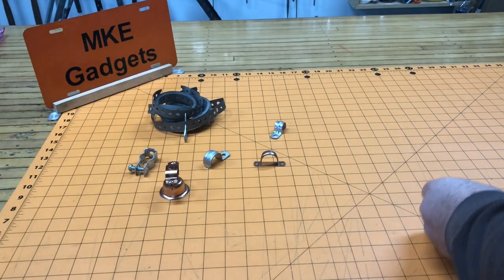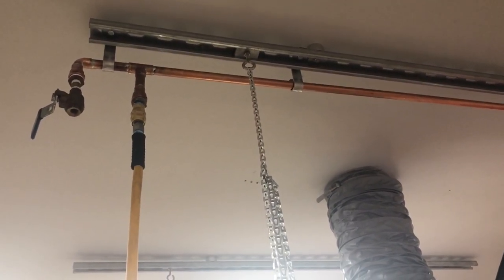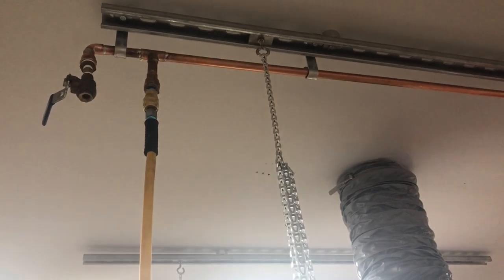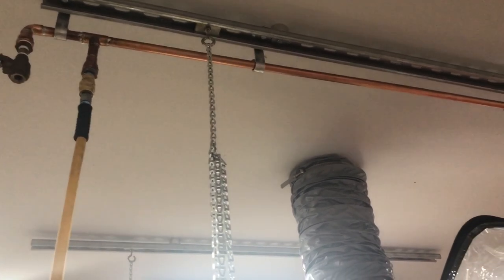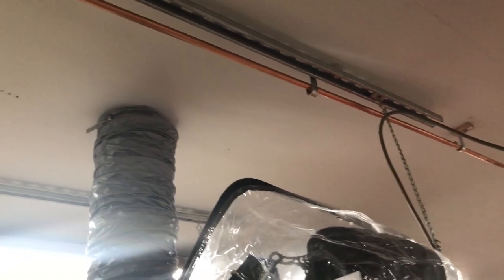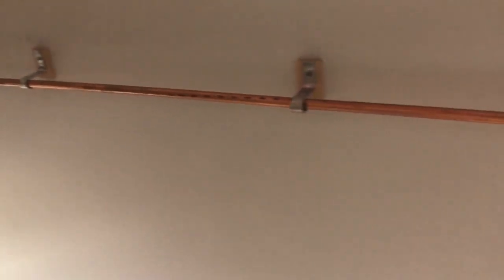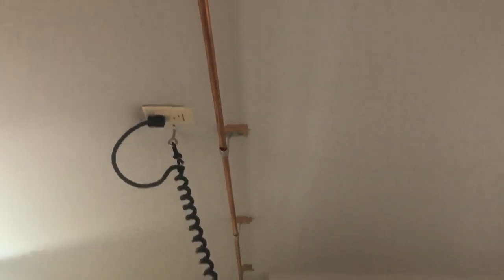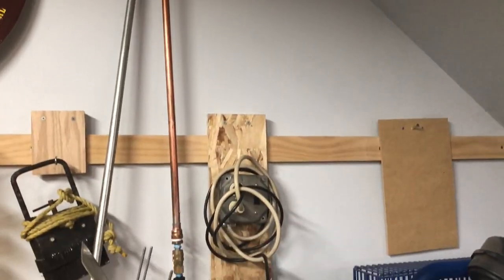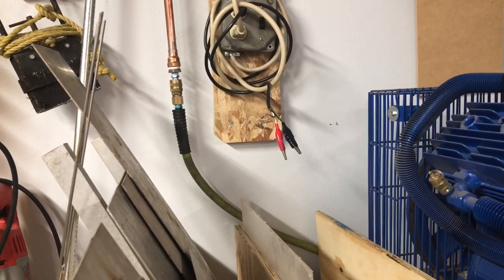Let's go take a look and see how this project finished up. Here's the drop over by the welding booth, and the valve there is a drain — that's the farthest from the compressor and any condensation will be cleaned out there. Right here I bolted it to the unistrut. The air line connects to it and feeds the pipe right by the compressor.